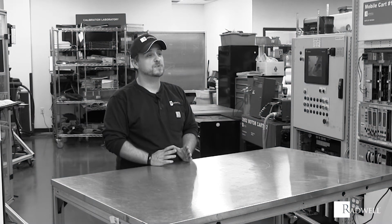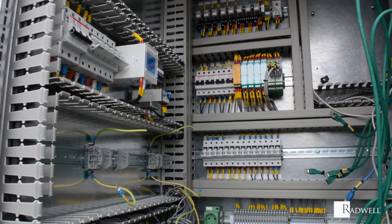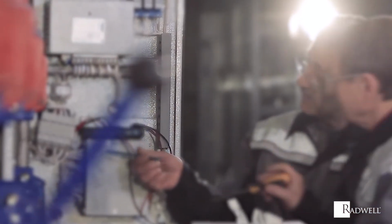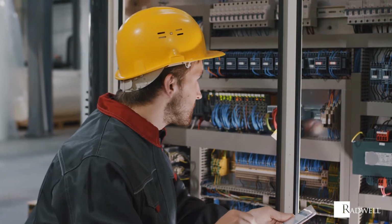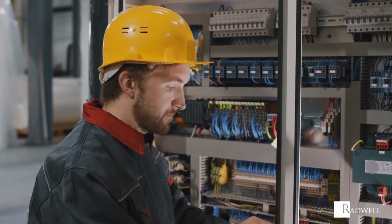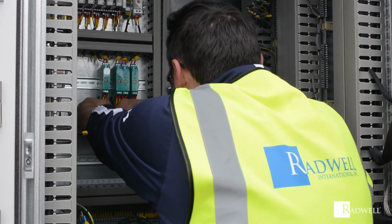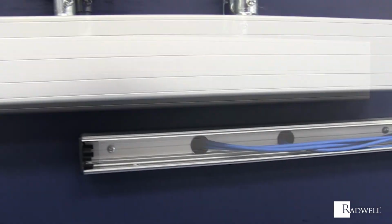The biggest difference between these two types of wire ducts is their design construction. Slotted wire ducts have slots or fingers where the cables are fed out of. Slotless wire ducts are solid trays with no slots or fingers for the cables to be fed through. This design construction difference leads to another difference. Slotted wire ducts allow for more customizations, organization, and the ability to reroute when needed. Slotless wire ducts are not easily customizable and are typically constructed and not touched again after.